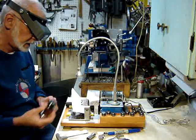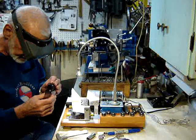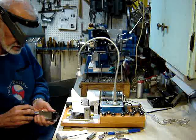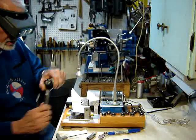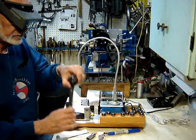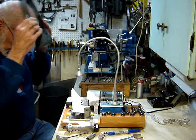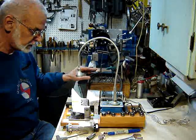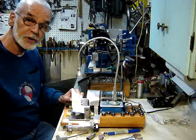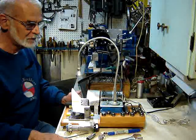The secondary point angles have the same angle as the primary facet. At this stage we truly are done — the drill sharpening is complete. We remove it from the chuck, and that's it. Another possibility with this unit is point splitting, but that would make the video too long, so we'll leave that for another time.